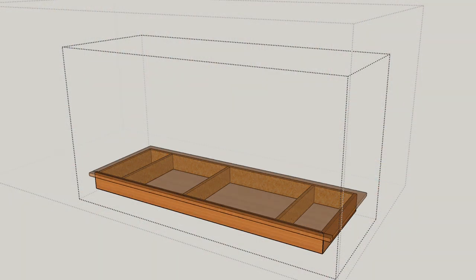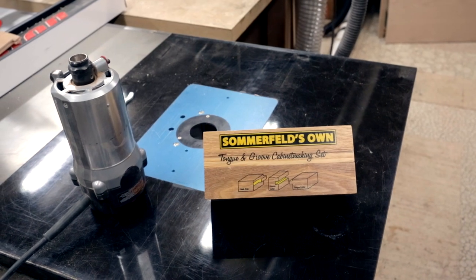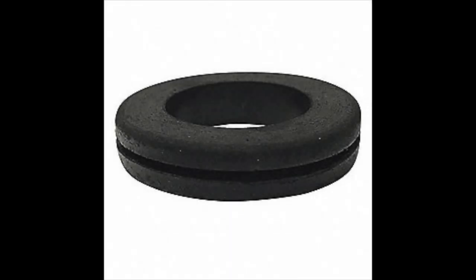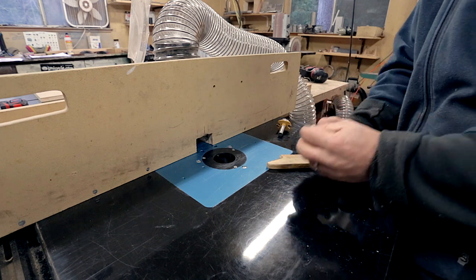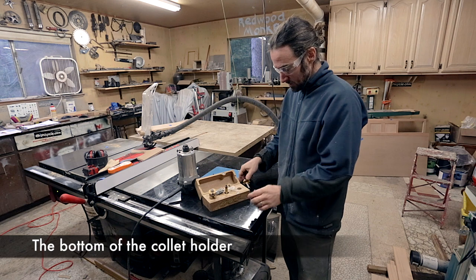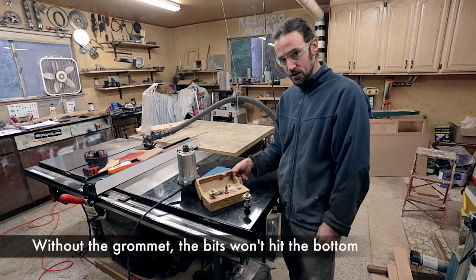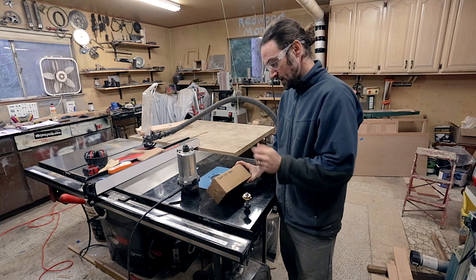Now that the kick area is made I can move on and make the cabinet bottom. Normally we would just use a simple piece of plywood and the face frame would cover up all the edges. However, in my design the bottom edge would be exposed so I have to hide the ugly plywood edge. I use a tongue and groove matched router bit set for this operation. One trick I use is to stick a half-inch router grommet in the collet holder. The bits need to sit at exactly the same height to match correctly, and the grommet allows me to easily set the same height every time.